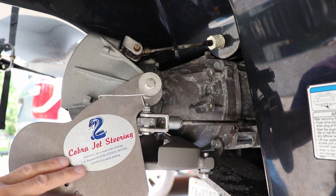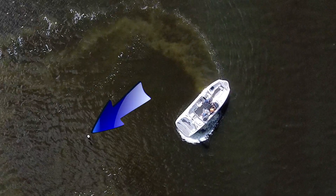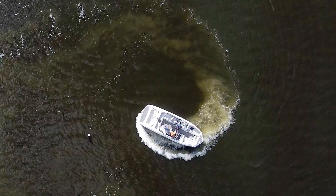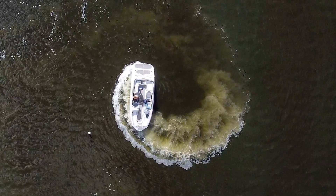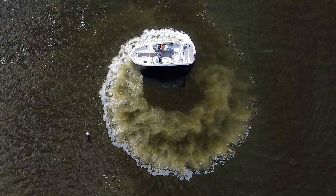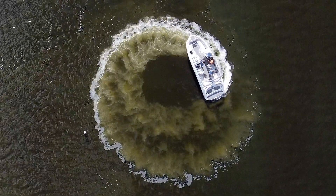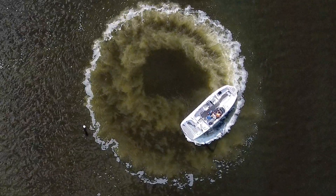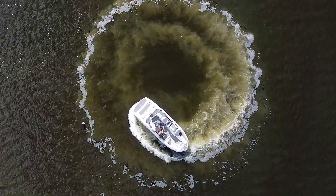We're out on the open water with a stationary buoy as a reference point. I've taken the steering wheel, locked it to one side, and pulled the throttle handles back to the first notch to lower the buckets for reverse. As the boat begins to move in reverse, you can see the water actually pushing out from the side. Look how tight we are able to make these turns in reverse — I love it. If you have one of these earlier model boats I highly recommend putting this in. Don't worry about which fins you have as it should work with both brands. If you have the Cobra Jet steering fins, contact Jeff at the email down below and he should be able to help you with the right parts to make it compatible — you wouldn't necessarily have to change out your entire fin system.